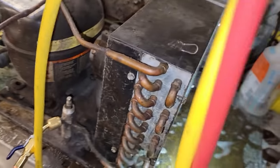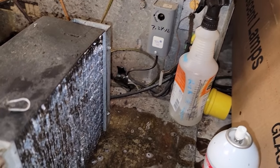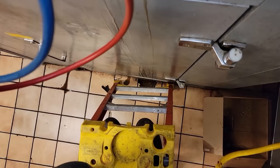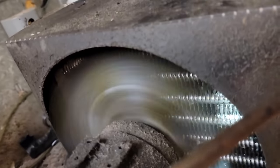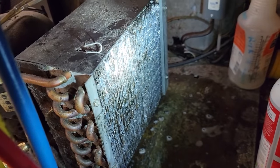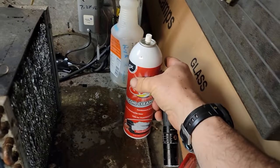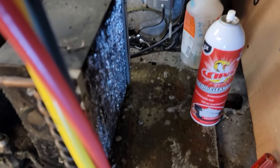We used my little green brush just to get the big chunks off the top, streamed it out a little bit. I used a little bit of water from that bottle. We've got a nice airflow coming through now - so it's clean. It looks like hell still but you can't beat something up for 30 years and think there's going to be a miracle in a can. I would say this is probably the closest thing to it. Brought it down quite a bit from 140-something - we'll know once we dry off the coil.